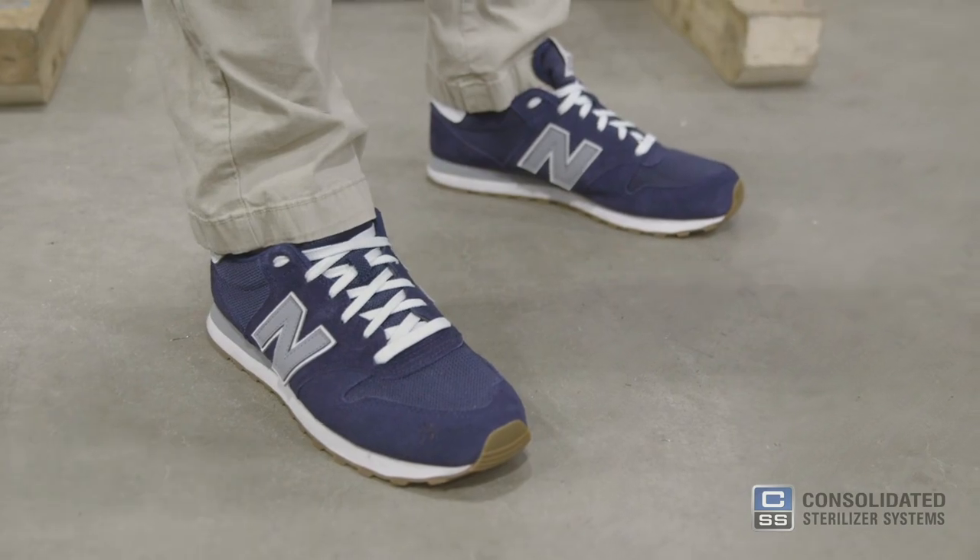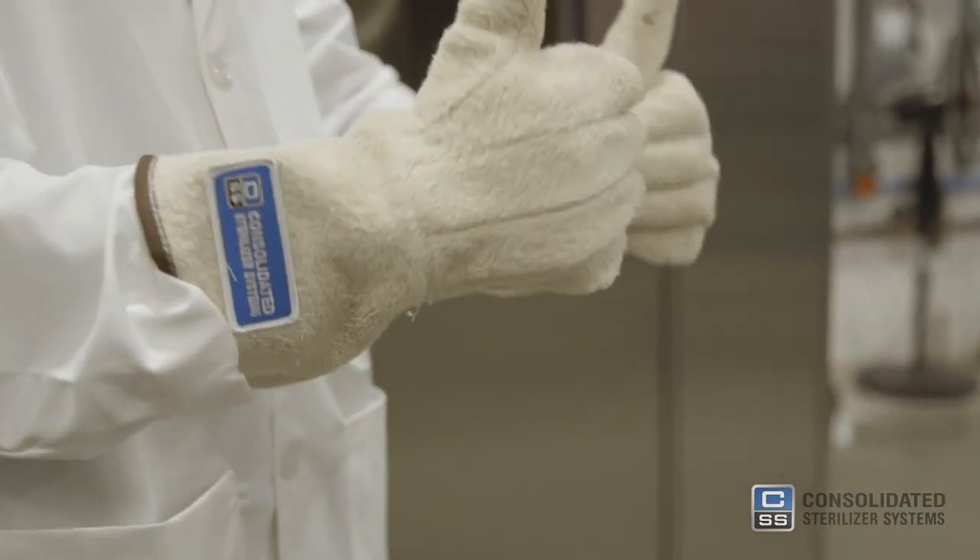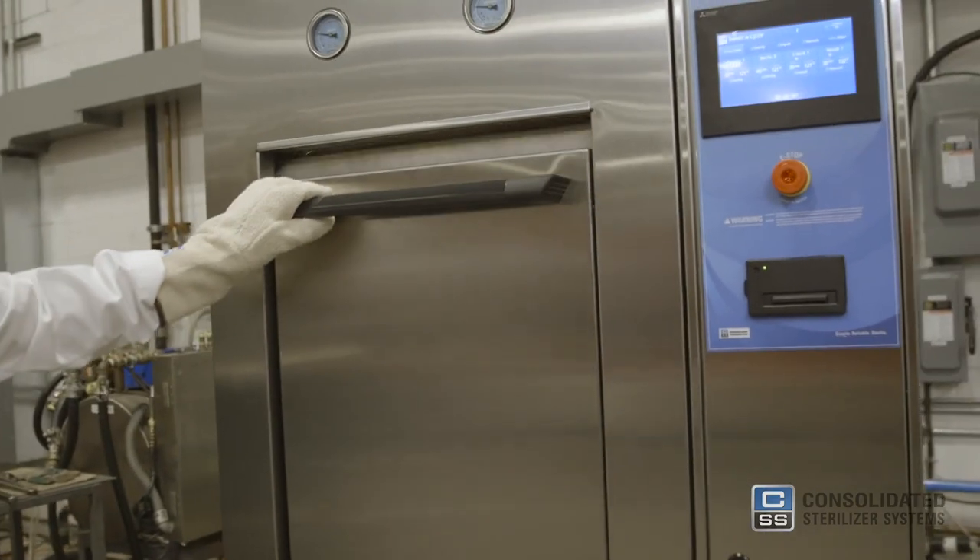Before you run a cycle, you should put on some basic protective gear. Remember, autoclaves use steam to kill bacteria, so these devices are inherently hot. To prevent scalds or burns, your protective gear should include closed-toed shoes, safety glasses, heat-resistant gloves that completely cover the hand and forearm, and a lab coat. Although the exterior of the autoclave is cool or warm to the touch, it's recommended not to touch metal surfaces, as these can be hot even when the autoclave isn't actively in use, and to keep hands and arms clear of the chamber door.